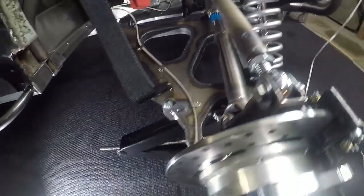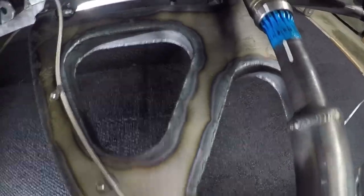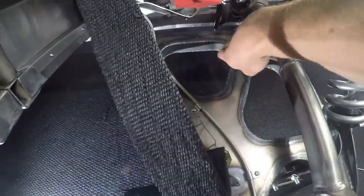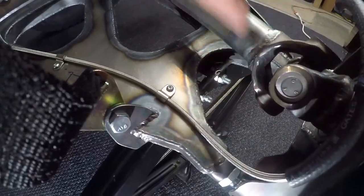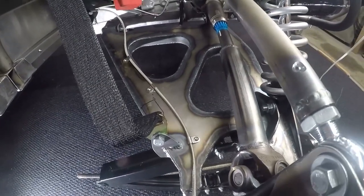After I had the spindle, next was the lower control arm. The lower control arm needed to be strong enough to carry most of the work of the lower suspension, so I needed to set this up so that it was pretty robust. I set it up with templates, figuring out what would work to clearance everything, and worked out the clearance I needed to clear the drive shaft. I have a whole separate video where I go into detail as to how I made the lower control arm — I'll put a link to that right here.